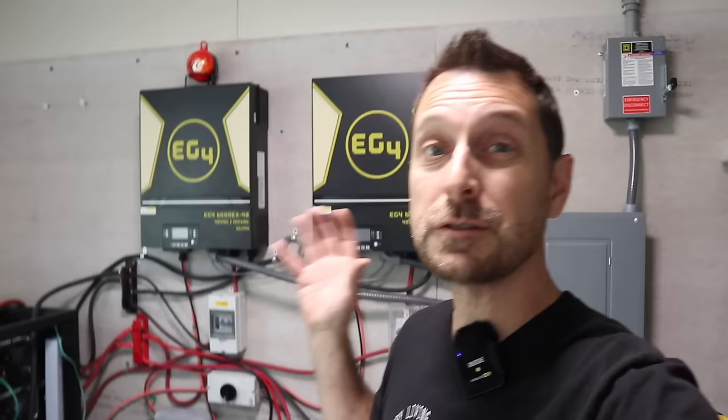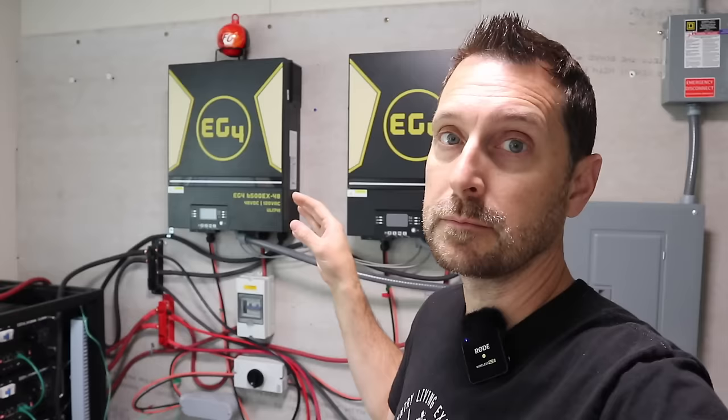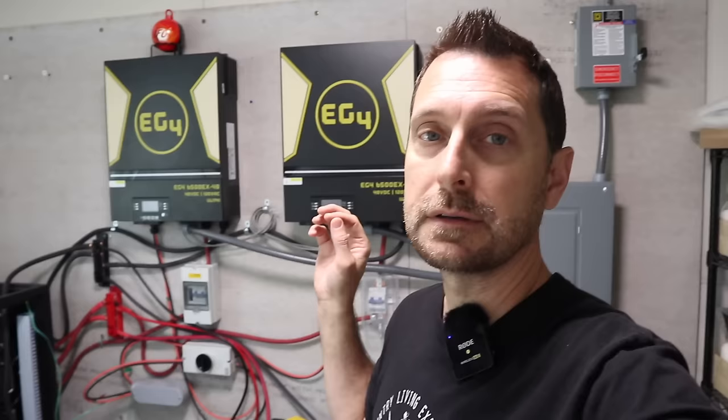When planning out your system, you need to understand where the equipment needs to go in the house. Our electrical panel is in an odd place, so we couldn't put our solar next to it — we actually constructed a room on the back of our house to accommodate it. You need to place the equipment in a conditioned space. These things run hot, and the operating temperatures are very specific, as are the operating temperatures of the batteries. So that's something you have to keep in mind when planning.